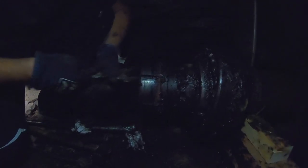So, the disc is pulled by several bolts against a metal ring which is cone-shaped. This one slides on another metal ring, which is also cone-shaped on the outside, but sits flat on the axle and has cut-in wedges. By pulling the two metal rings and the disc together, they are then tightening around the axle of the water wheel. It's just friction transferring all that torque, metal on metal on metal, all being clamped together.